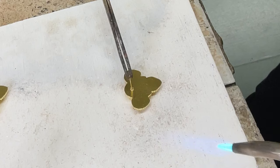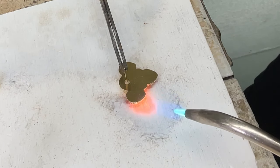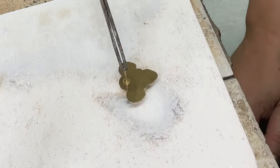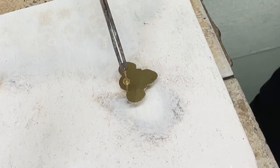I've got my flame parallel to the board. Just keep your eye on the solder — there you go, that's it. It doesn't take much time at all because 14-carat solder melts at a relatively low temperature. Just put the heat on the piece, watch the solder, and it'll flow. If everything is in good contact — which it is because I was gently resting my fingers here — it's just going to flow together and that's going to be that. That's how I do my posts.